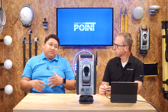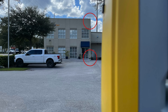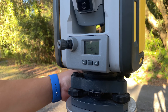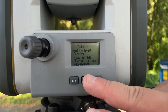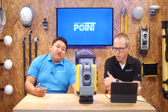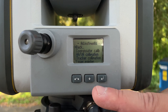We set up right outside of our building, got our equipment leveled out. From there, we're shooting the very bottom base of the building and the very top of the building — that's about 15 degrees away from each other. At this point, press the Enter button all the way to the right from your bubbles, and it'll take you to the setup menus inside your face display. You have the back-and-forth arrow and the down arrow buttons. Press the down arrow all the way down to Adjustments — it'll be highlighted by a little arrow — then press Enter to go inside the adjustment menu.